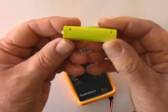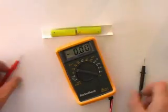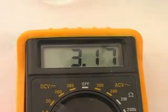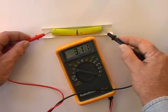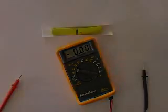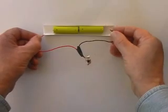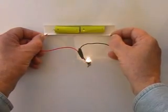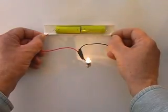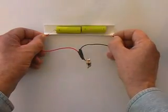Interestingly, if you take a second battery and touch the plus end to the minus end of this battery, and check the voltage generated, we have 3.1 volts — a little over 3 volts. We actually add the voltages: 1.5 plus 1.5 equals 3 volts. This is called a series connection. Using this 3 volt configuration with our bulb, we can see it is a lot brighter. Adding another battery would create 4.5 volts, but this bulb is only rated for 3 volts — using a higher voltage could damage it. So we will stay with 3 volts.